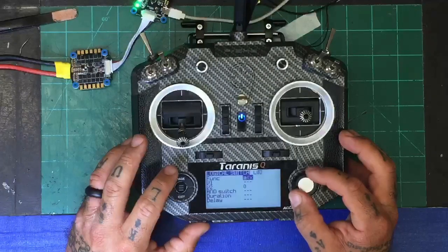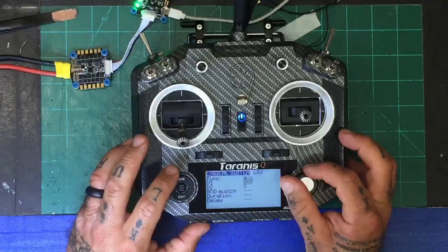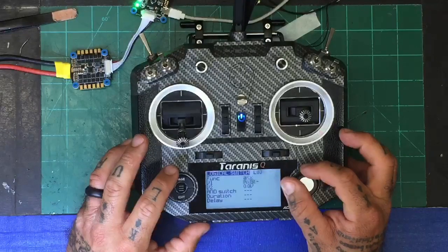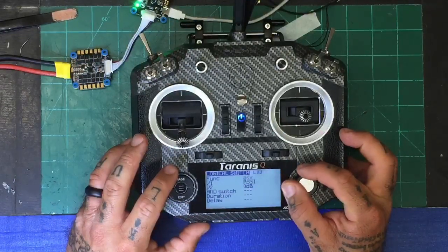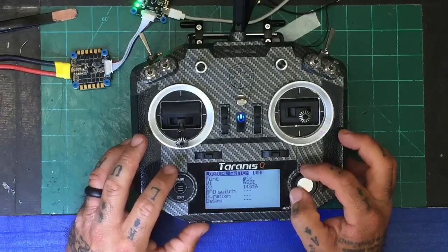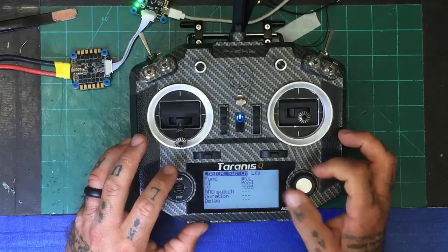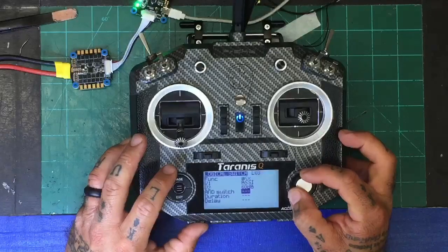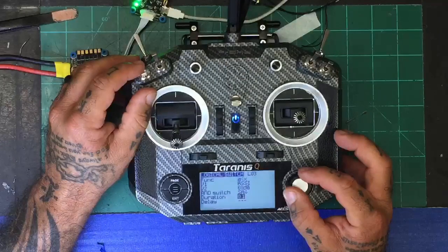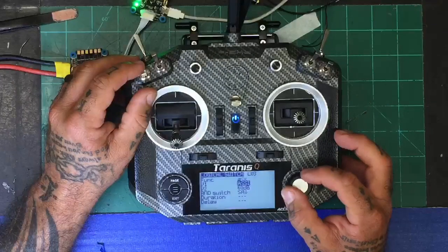Okay, it's A is less than X, that's right. So if my RSSI dB, I don't know, is less than, let's just say, I'm going too far here. Let's say it's less than 60 and I'm armed, okay? And it lasts longer than, no, that's not duration. This is going to be delay. So let me go to delay.